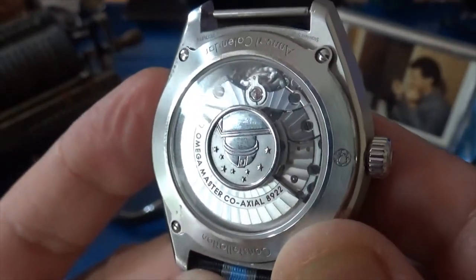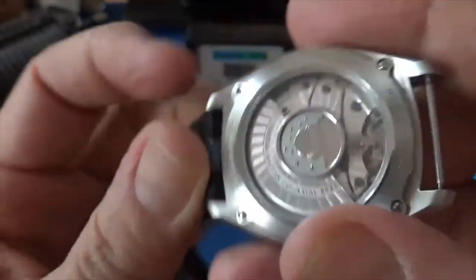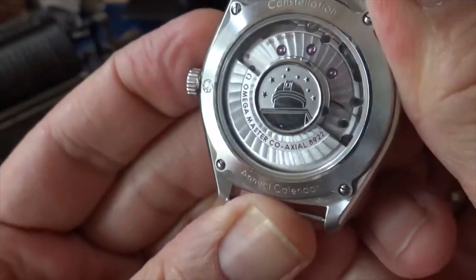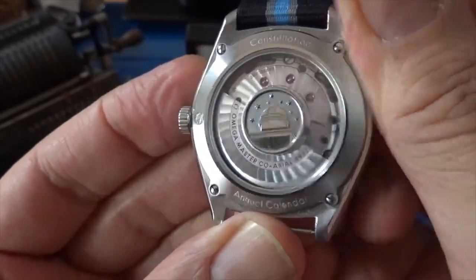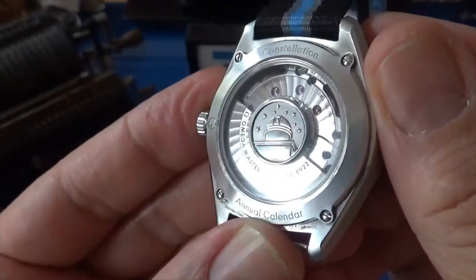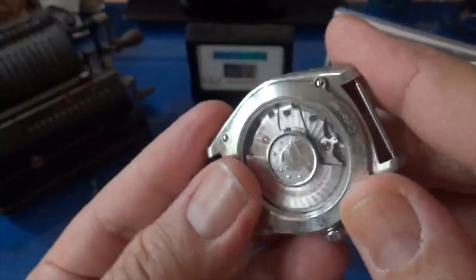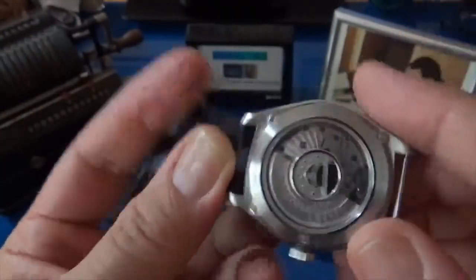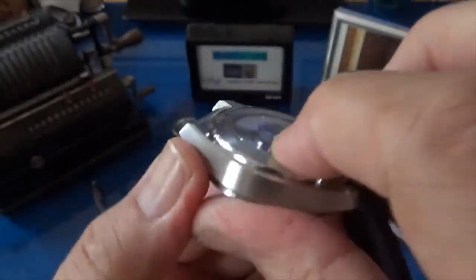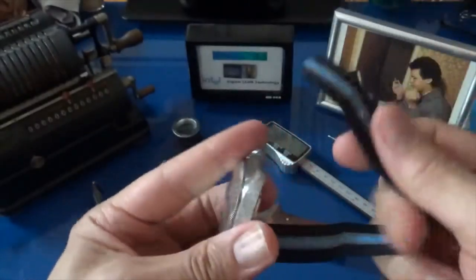There's just one lever, primarily serving as the anchor for the hairspring. The weights on the periphery of the balance wheel are how the wheel is adjusted. The movement has beautiful finishing — Côte de Genève, perlage — and on the caseback there's the observatory motif with stars designating the number of times Omega won awards with their earlier movement designs. I also like the way the cap covers the pivot for the balance. The observatory symbol covers that part of the movement, and it's set into the sapphire as a flat, smooth surface so it wears very well on the wrist.